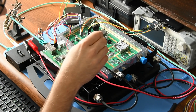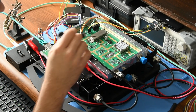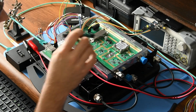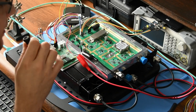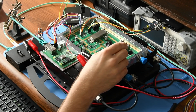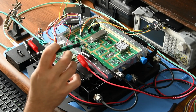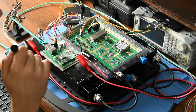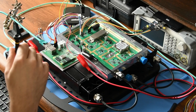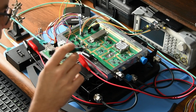Right after that we've got the RF circulator and the dummy load. Then there's an SWR bridge — a double directional coupler. So between the isolator and the output there's a bridge to tell us how much power we have at the output. That's the incident power, and we can also tell how much power gets back from the load — how much power is reflected back to the transmitter.